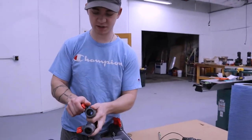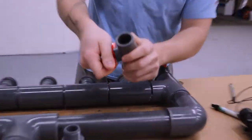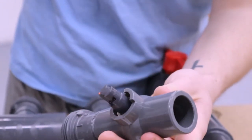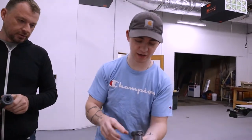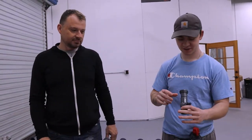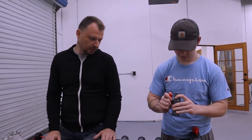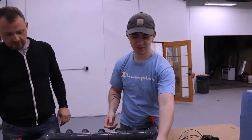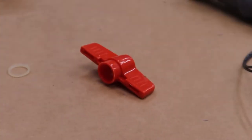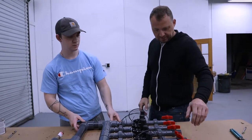While we were cleaning up we figured we'd test to make sure all the ball shutoff connections work, because there's a risk of gluing them shut. My dad was testing one and it broke — completely glued shut. You've got to be careful; I guess just don't use as much glue, but then you run the risk of it leaking. We'll pick up a new shutoff and union and fix that off camera, but we wanted to put it in the video so you can also see our fails.